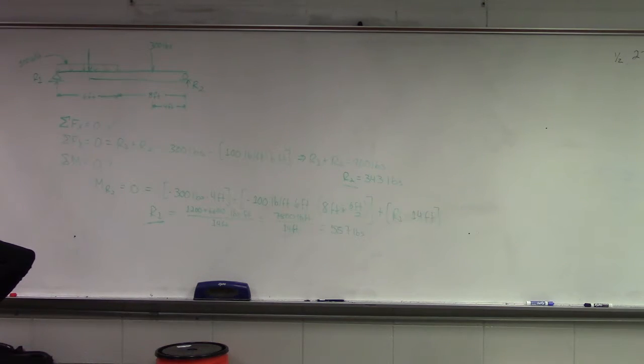That's a hell of a word problem. So 1 to 3 is height to width for your shear wall, right? But it's also length to width for your diaphragm, your flooring system. So it's the check you use when looking at it in plan, and when looking at it in elevation.